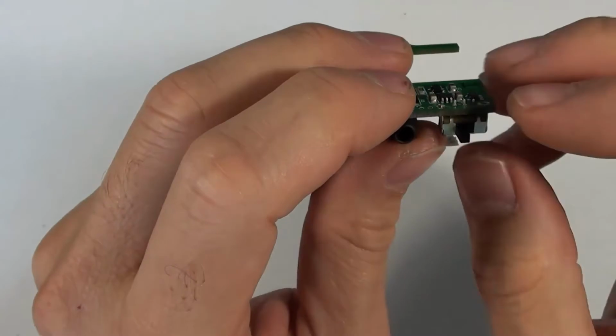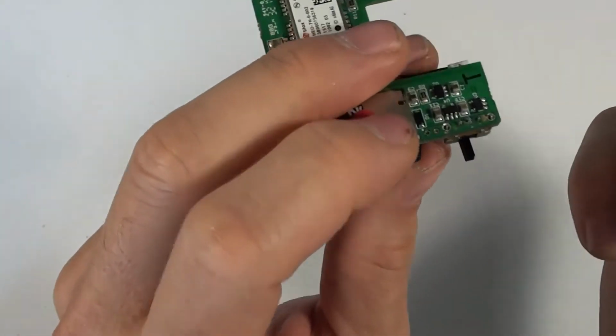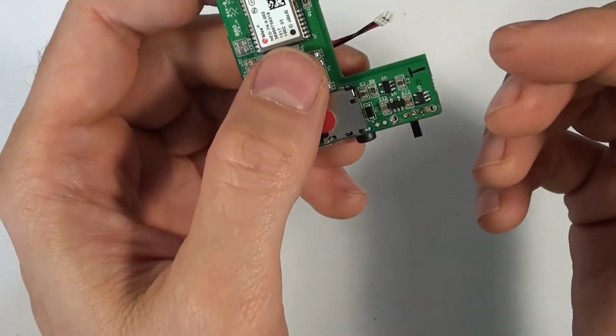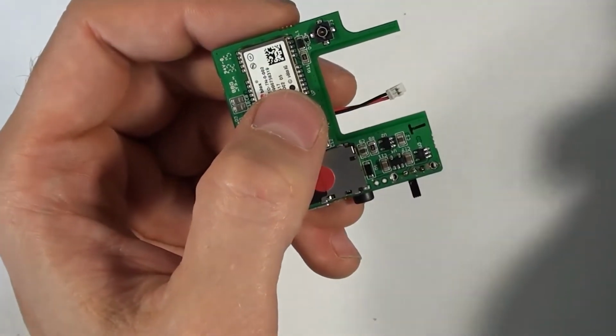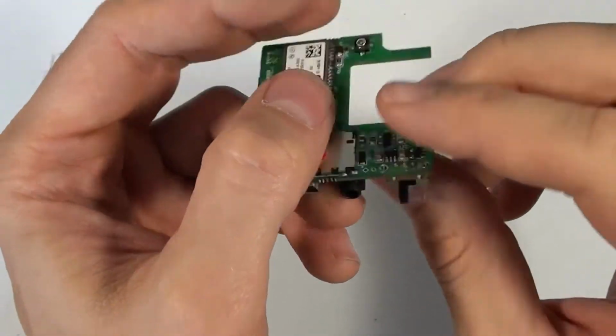If you have any trouble pushing the switch in, if it gives you some resistance, it might be that there's still solder in the holes. Again, you can try a solder wick to remove extra solder, or if it's really stubborn, try feeding some fresh solder into it and then sucking it out again. Usually that'll do it.